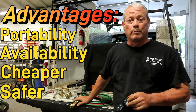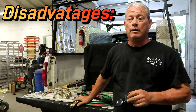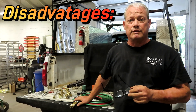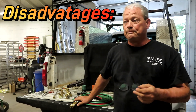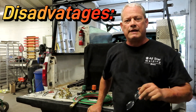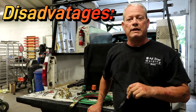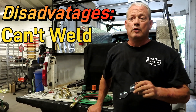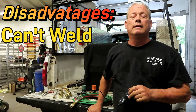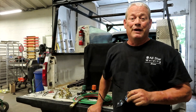The disadvantages: you can still cut, heat, and bend with propane — I can heat half-inch round bar to glowing red in 15 seconds and just bend it. The only real disadvantage is that with a propane setup you cannot weld. You can do torch brazing, but gas welding requires acetylene. That's basically it.